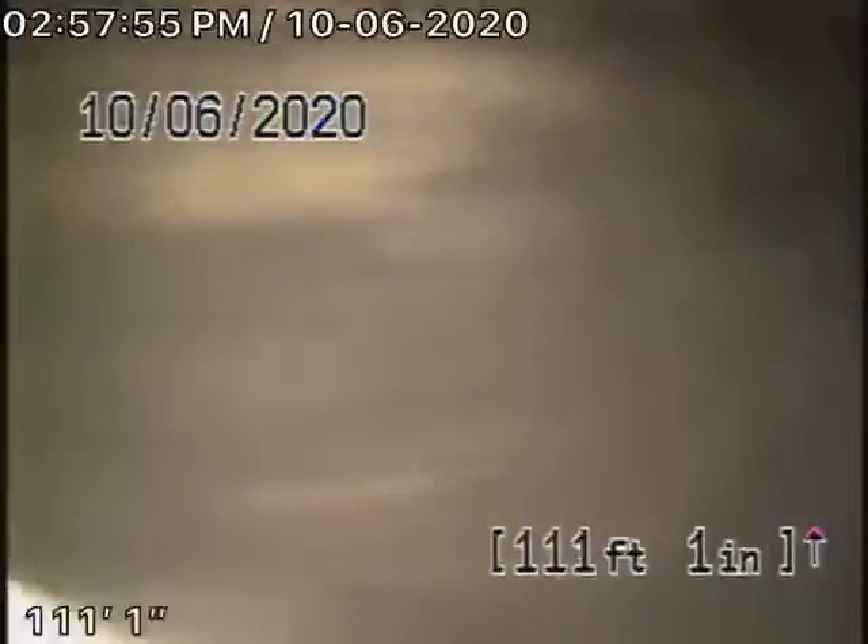We're here at 10749 Springfield Avenue in Porter Ranch. There is a 4-inch clean-out located where the pipe exits the house in the front, but we chose to run our camera from a 2-inch roof vent because we like to check as much of the main line as possible.